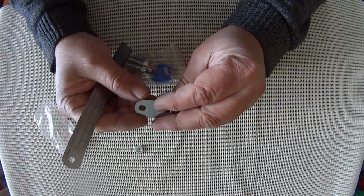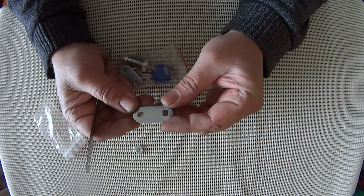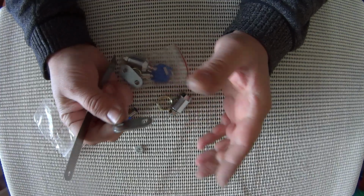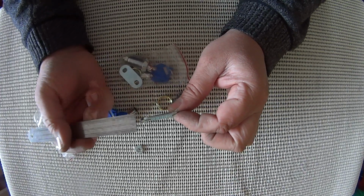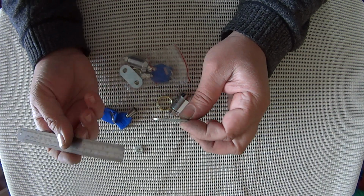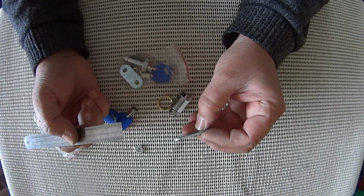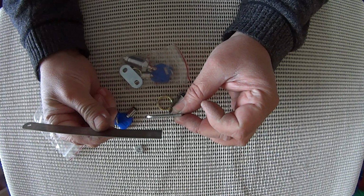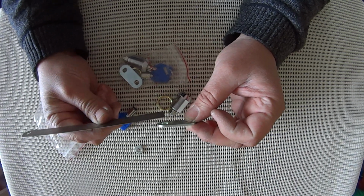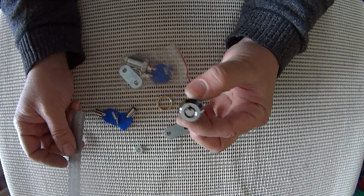The cams. Now the cams, they do come in various sizes. We do have different ones on our website, so please go through and check them out. You would pick a cam that suits your needs. Not every cam is designed for every cabinet or every mailbox or anything like that. You need to modify and bend this cam, cut it down, shape it to suit where your actual lock is locking into. So please do not buy one and say, oh, it didn't fit, because it won't fit. It needs to match what you have. So if you have a mailbox perhaps where it's locking in back here, if you buy a standard lock, you need to bring this cam backwards by bending it, cutting it, or putting a flange in front, whatever you need to do to actually make it lock into position. Same with the cupboard and same with any other installation.